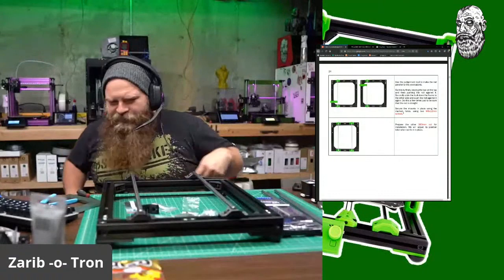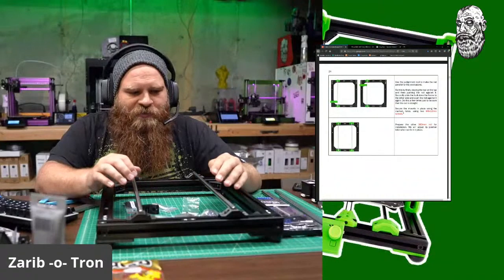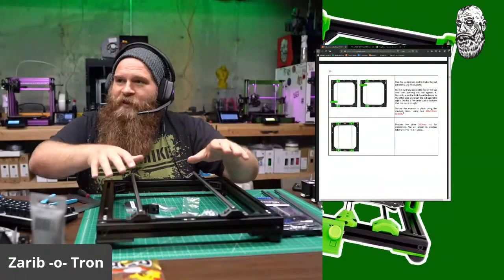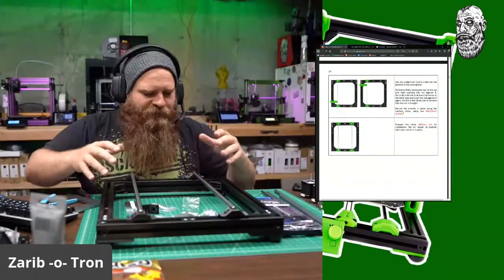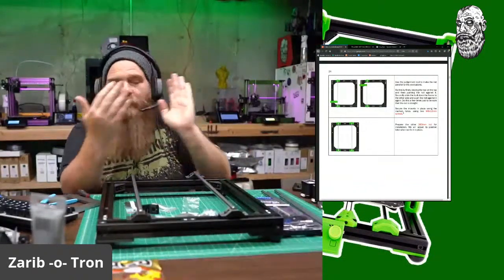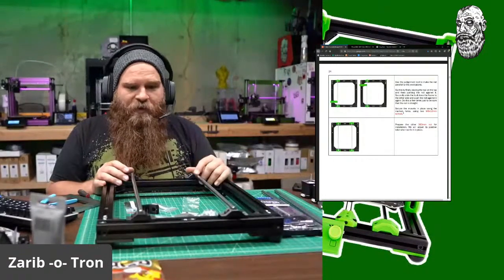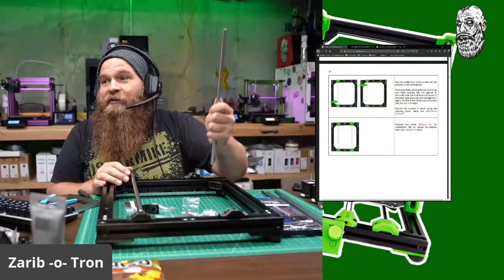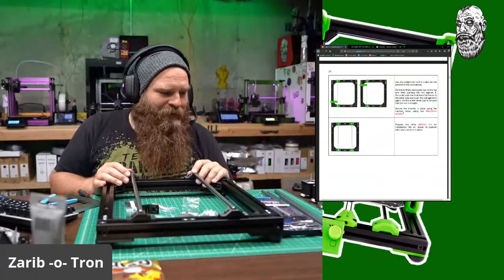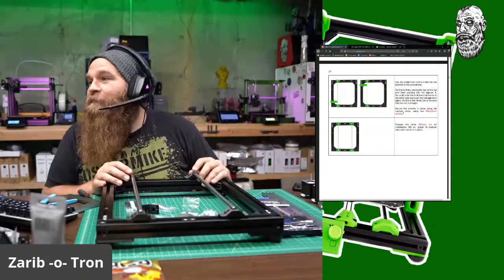This should be advantageous on all because there'll be less play and less bend. One thing about the 8 millimeter rods on a standard Prusa is they can twist. So if you have any axial forces, they're going to twist. Also, the extruder is top heavy, and that can bend. So this should help with that. I will quantify that when I get a chance, but they are much thicker, and they feel like a gosh darn weapon in my hand.